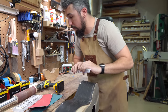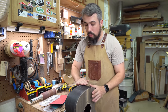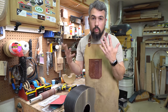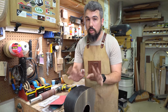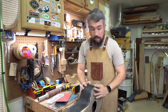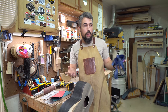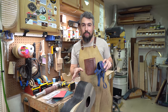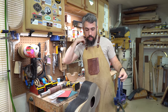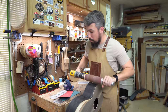The other thing that is incredibly important is this upper section right here — this is where the neck is going to attach to the guitar. You're going to want to get this area very, very smooth and get this angle here as best you can to where you want it. Once this area is sanded and leveled, you don't want to be touching it ever again for the rest of the guitar build because it's going to affect that neck angle. We'll do a little bit of sanding in real time and then a montage. I'm going to wear my wood dust respirator while I do this, so when I talk it might be a little bit muffled.